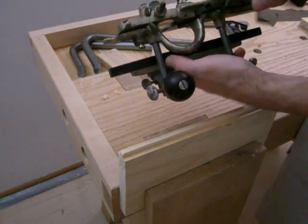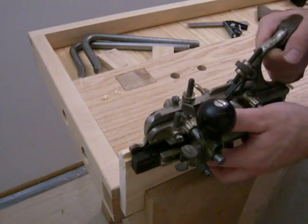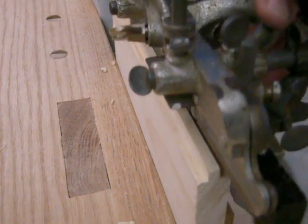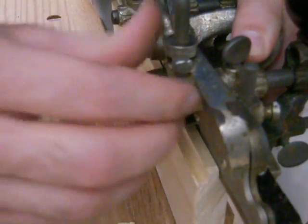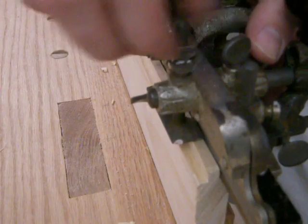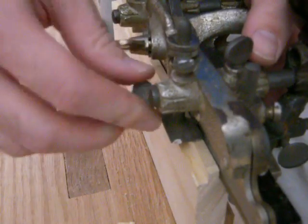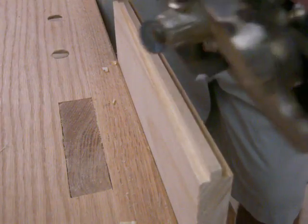So, on this one you can go ahead and set it back for the lower two holes on the fence this time. For now, the distance for that doesn't actually matter, because what I'm going to do is go ahead and set the depth stop. And for setting the depth for the groove, what I do is I take this and I rest it on the very edge here, on the shoulder, and then I loosen this, and I just drop this depth gauge, or depth stop, all the way down until I hit the tongue, which is right there, and just when it starts to lift just a little bit, feel it hit, back it off just a touch, tighten it down, and then what you want to do is move the fence out so it's not in your way.